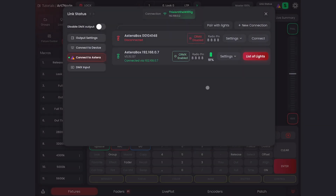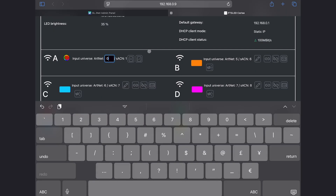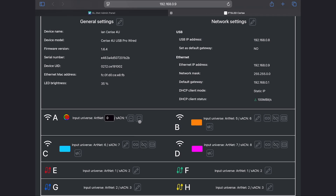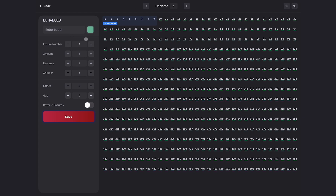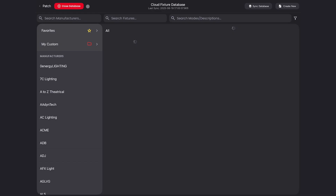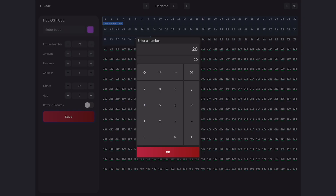You can see it connects instantly. Now let's test this out — I have a Luna bulb on universe one, and the Cerise will give it universe one. The Helios tube will be on universe two, and the ART7 will give it universe two. I'm going to the ethernet IP address of the Cerise and changing the A antenna to SACN universe one. Back in Blackout, I'll patch a Luna bulb in mode 137, put it in universe one at address 101, then add the Helios in a crazy mode on universe two at address 201.